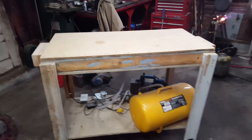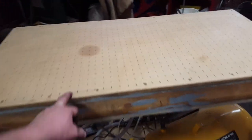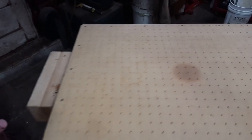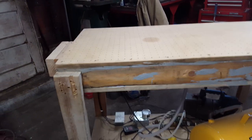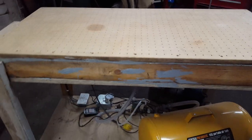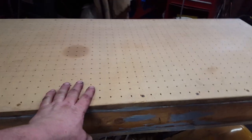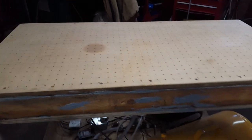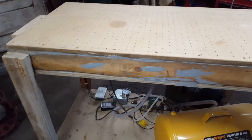So I've decided to finish it. Let me show you what all I've got done so far. This table here has got a bunch of little holes drilled all the way through. I think it's a two-by-four table, built out of two-by-fours. On the inside I've got it jam-packed full of two-by-fours so there's not as much air volume in here, so the vacuum can suck just a little volume of air out and then start actually having a vacuum.